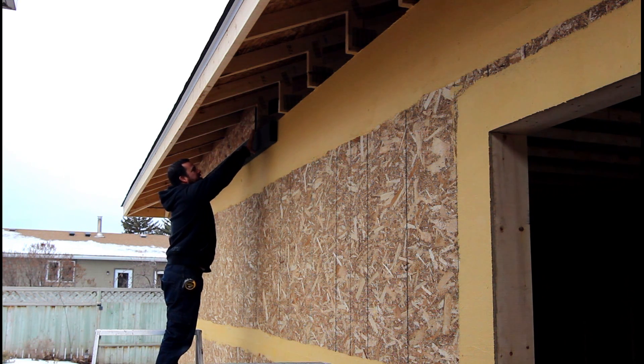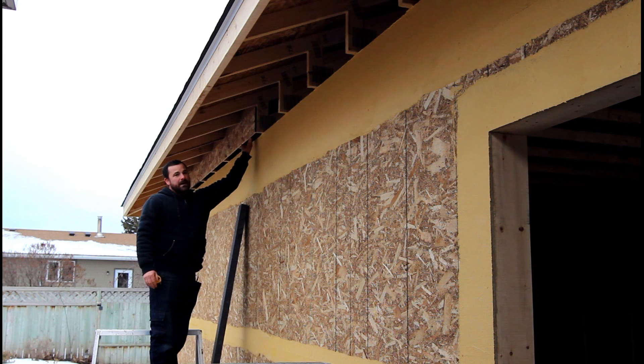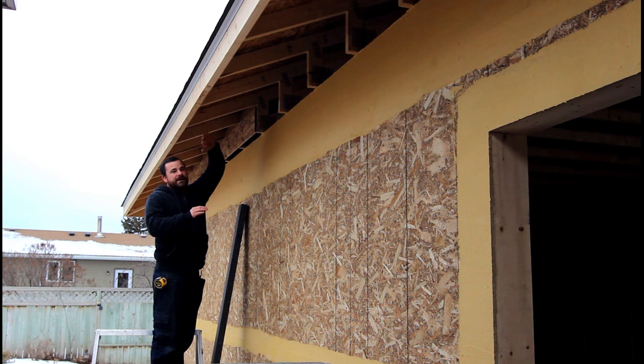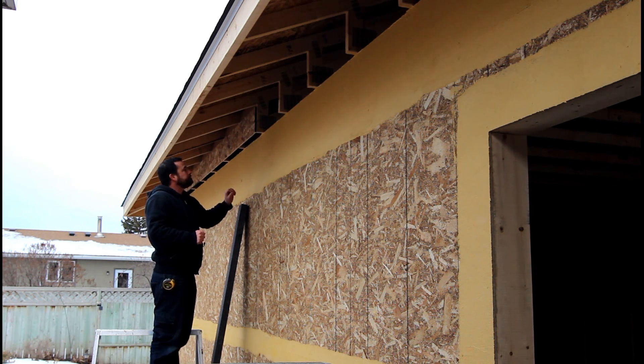You can see the insulation is up there, and when I do my blown-in attic insulation it's coming right out to here — so I'm totally covering all the wood in my wall and the two top plates. I have a nice even amount of insulation all the way around. That stops thermal bridging. It's a beautiful system.